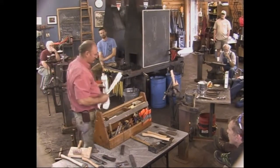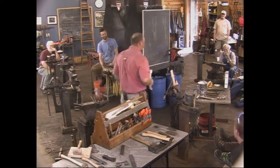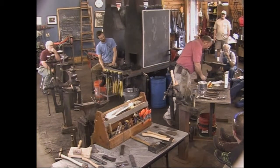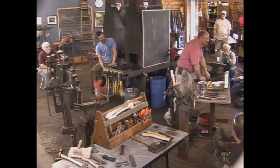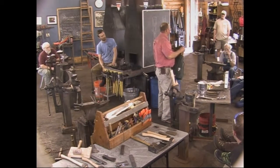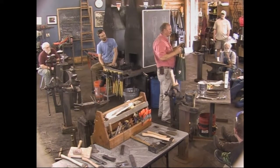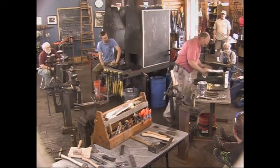And speaking of rasps, these are still in the original shipping container. I'm going to give Janet a quick plug. Everybody's probably seen her stuff. She makes these nice file rolls for me, and we're working on one for the rasps, but they're a little grabby, so they grab the fabric and have different issues. But take care of your files and your rasps. They'll last a lot longer if you put them in something. If you throw them in your toolbox and they rub together, they're just wearing out. Nothing wears out a file faster than rubbing it against another file. The same thing goes for these rasps.